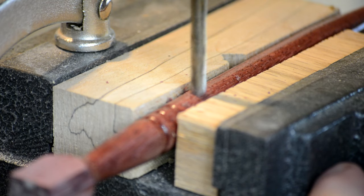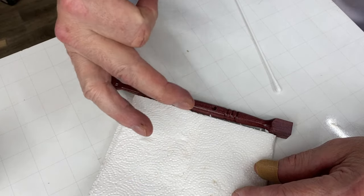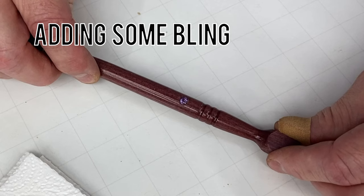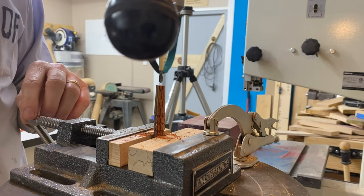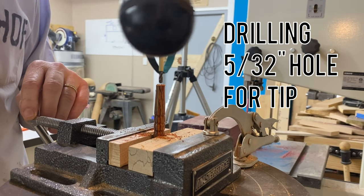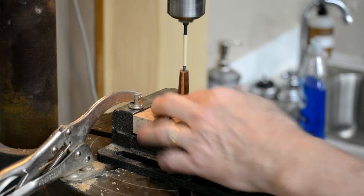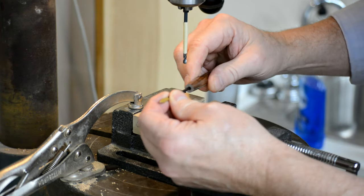I wanted to add another flourish to the purple heart pen I made for my wife, incorporating a small synthetic amethyst stone. I chose a drill bit that would make the right diameter hole and made a small indentation to accept the stone. While the center core of the pen takes the 1/8-inch ink tube, the tip of the pen needs to be a little wider to accept the rollerball nib. This turns out to be a 5/32-inch hole for those Bic pen inserts, and the hole only needs to be drilled down about a half an inch. I centered each pen on the drill press, but you could carefully do this on a vise with your hand drill.